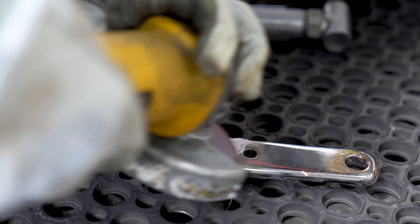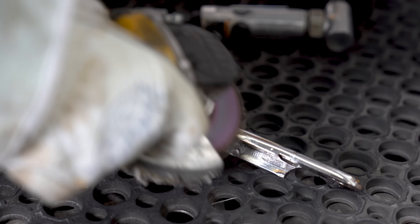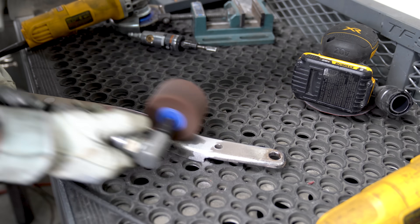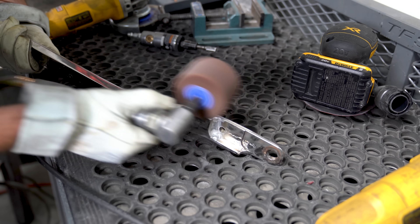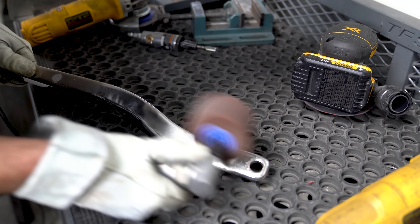My process for taking it down is pretty simple - only three tools are needed. First I hit it with the flap disc, which takes the majority of the metal down to a uniform height, but it's not for blending it into the parent metal. There are literally fractions of material remaining above the surface - that's just years of experience and practice. The sander is used for blending. 80 grit paper is usually what I use to make sure the surface is nice and smooth to the touch - no undercutting around the toes of the bead, no high spots, no low spots. Once the sanding is done, the flap drum will lightly remove the sandpaper marks and reveal any final low or high spots, and in this case it's just for the final blending.